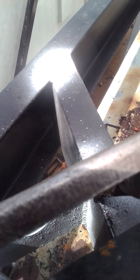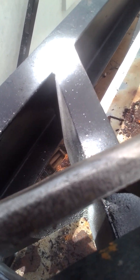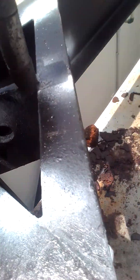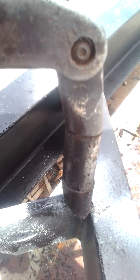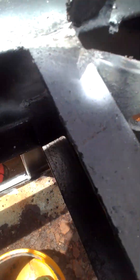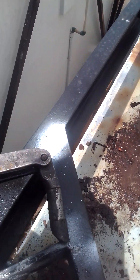It has been cleaned already. You now apply it — after applying your white, you apply your black. You look at it visually, very critically. You can also move the magnet. Look at the hole — it is well designed. We also spray this other side to check for defects.